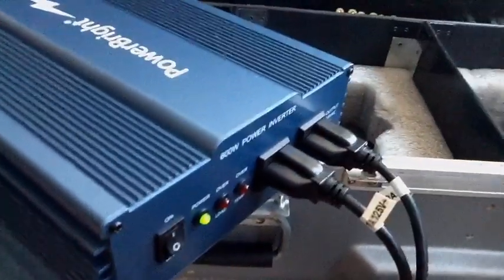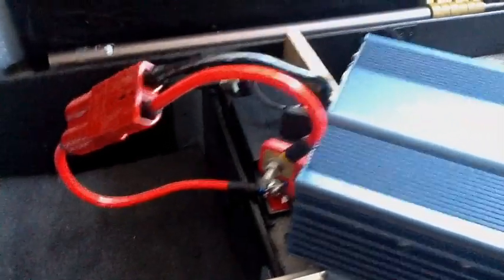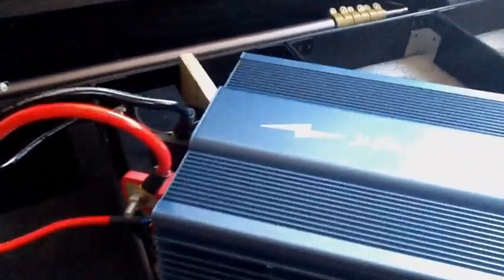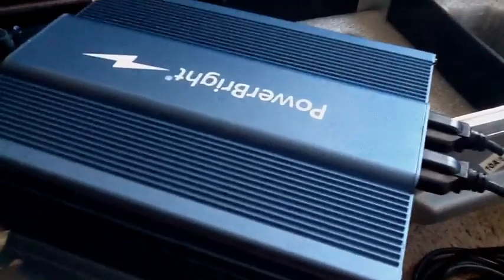Like I was saying before, I was getting an under-load situation — the battery was not supplying enough current to the inverter because the gauge of the cable was too thin. I went with 10-gauge at first; it was fine but really stiff. So I went with automotive Monster cables, and that proved to be a lot easier.